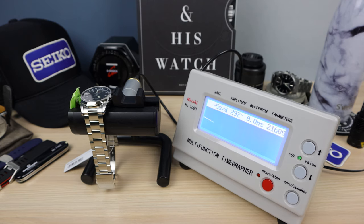So we have negative 5, 292 amplitude — very strong — 0.0 beat error, very nice. And so far, no snowflakes; the line is beautifully clean. But the rate is negative, and that is a rare sign — we hardly see negative Seiko movements; they're usually fast, not slow. But this one is not too bad out of spec. Remember, these are rated at plus 25 and negative 15 seconds per day, so it's a big variance and we're kind of closer to zero.